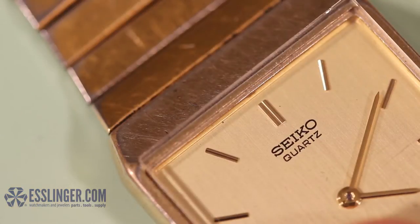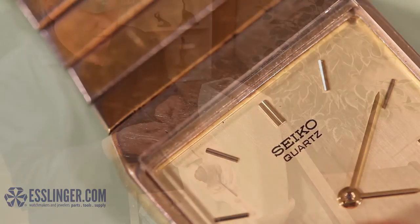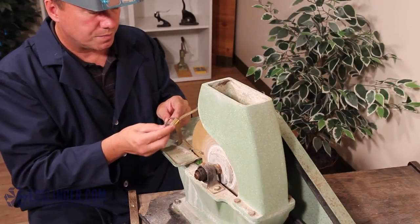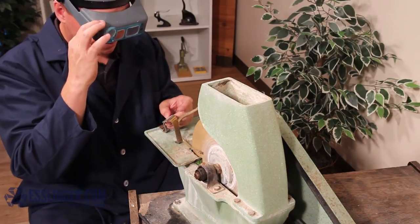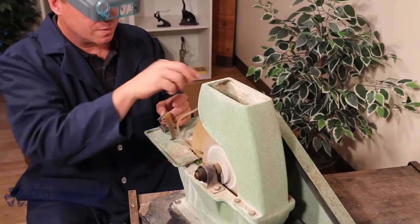Start by determining how much you need to change the crystal, particularly noting which sides you need to trim. Once you have that figured out, put on your safety glasses to protect your eyes while grinding. Then start your crystal grinder and lubricate the wheel.